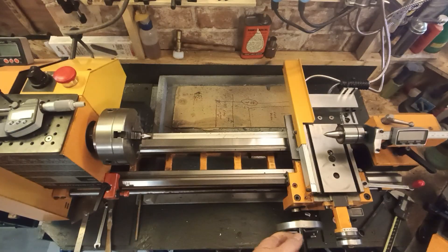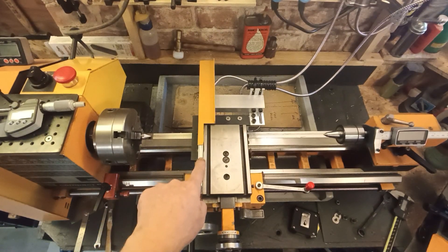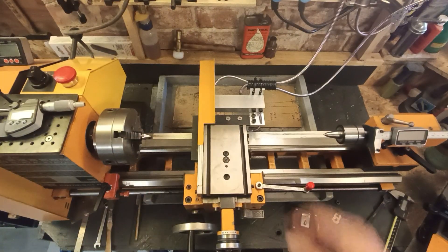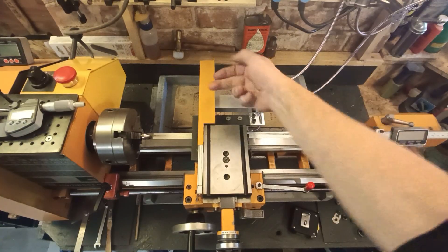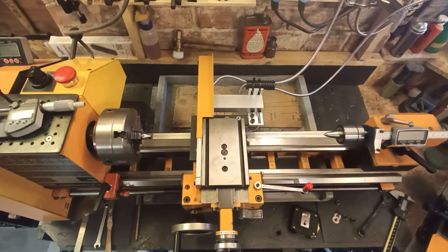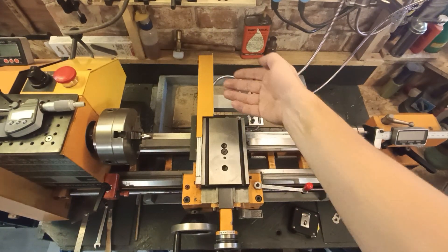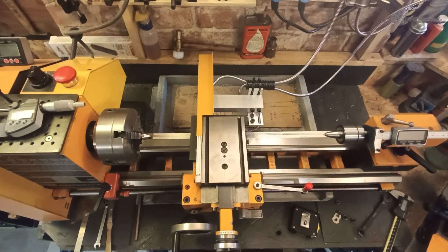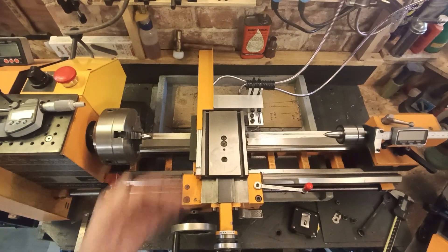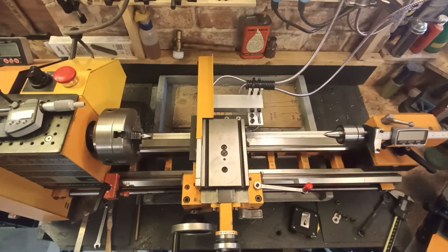The other scale is a magnetic scale. It's just an aluminium cover with a magnetic band inside, and the read head is screwed in here in this aluminium form. So when I travel with my apron or cross slide — this is the cross slide — the scale moves in front of the read head. It's sort of upside down; in theory the read head should travel on the scale, but it works. I've got the full travel for this part — I can go all the way back to the end, and all the way to the front.